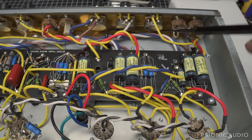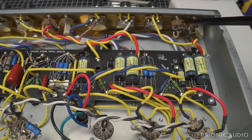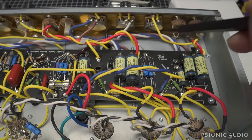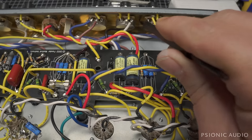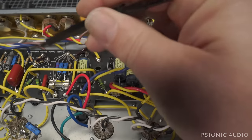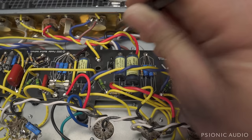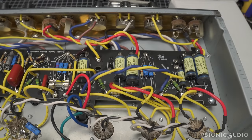Down here, you can see all the preamp grounds. This black wire coming out of the doghouse is made to this jack, which is fine if this jack is completely tight. We will make sure this jack is completely tight. On the old 60s ones, this wire would have been going to chassis right about in this area, going through the brass plate. They've got grounds made to this brass plate in a few places, some cathodes off the board, but they should have done this wire to here as well. It's just a more reliable ground than trusting an input jack. When everything's working fine, that's fine.